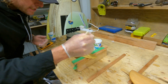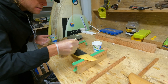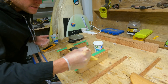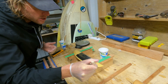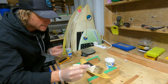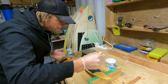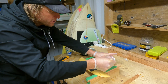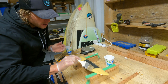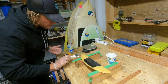If you're wondering how much resin to put on: you want it nice and thick so you can sand it back, but it'll only hold so much on a slope before it slowly runs over the sides anyway. So put it on thicker than you would paint, but then take some of it out with a light brush pass — and that's basically as good as it gets.